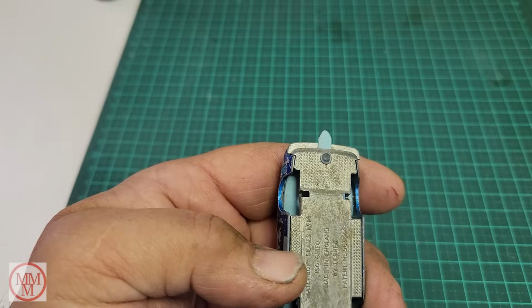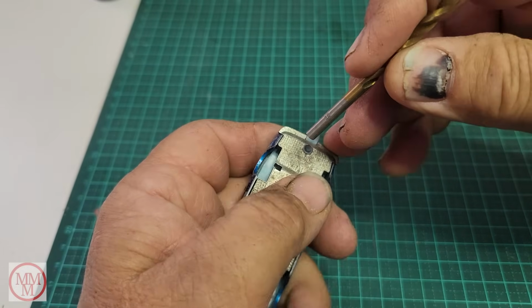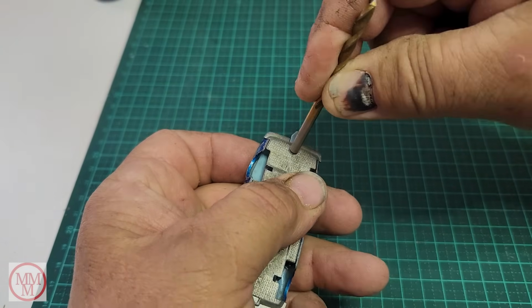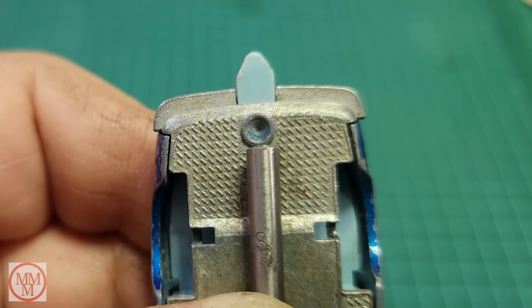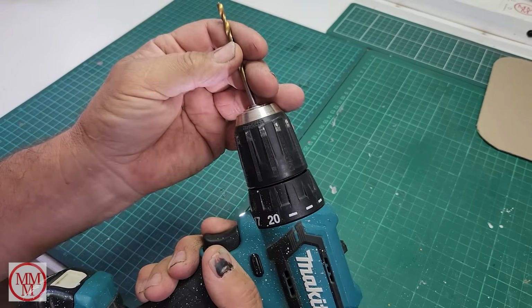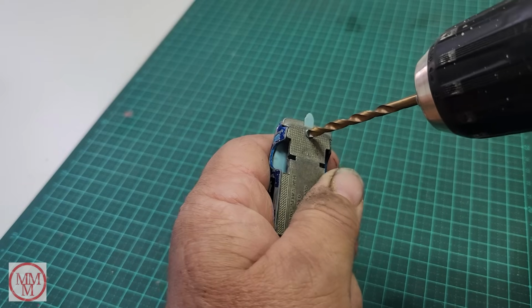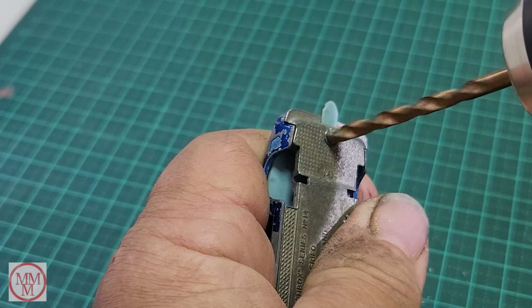In the meanwhile, I'm selecting a drill to drill out just the wide end of this mushroomed rivet that's been compressed in by mechanical means and flared out. So this little drill should hopefully take that outer edge off and not damage the base. So let's give it a shot. Try not to slip and drill through my finger, which would make for an entertaining outtake, that's for sure.